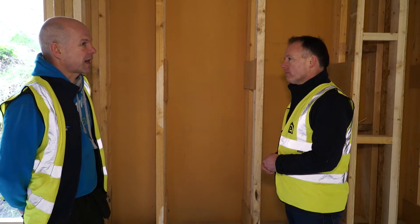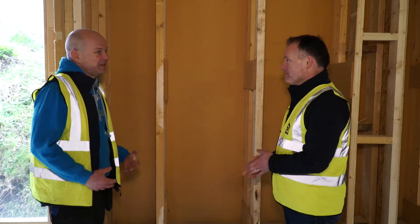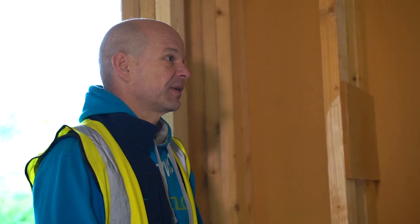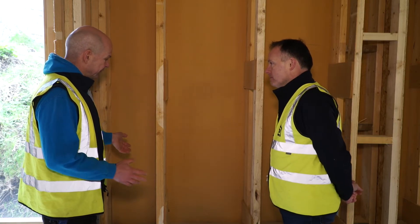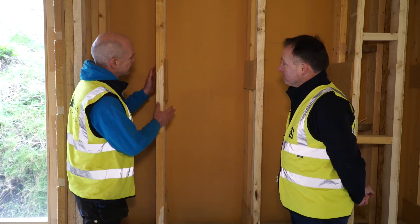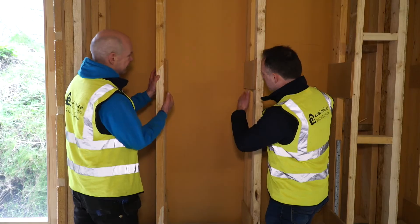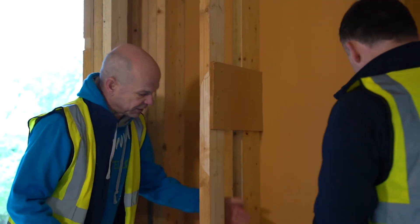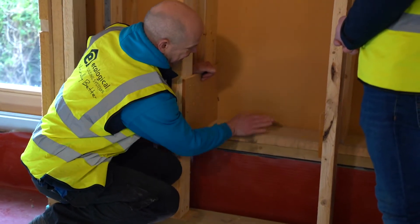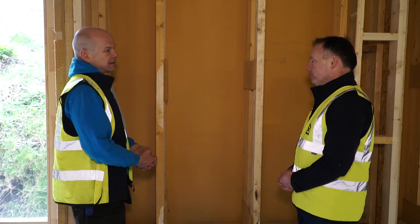The choice of cellulose — if I start talking about all the benefits I could probably be talking for another hour. Me being a cellulose installer is part of it, so for me it's the most accessible and easiest installation that I'm confident with. But the real benefit here is that I have a very complex buildup — quite a number of cavities and shapes to fill. You want to get around the plates, get in between the studs, and there's a step further down. I'm really keen to have an absolute gap-free, full-fill insulation, and with cellulose that's easy to achieve.